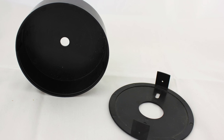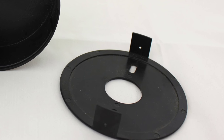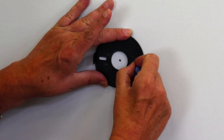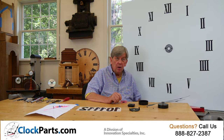The wall mounting bracket is attached directly to your wall using the larger coarse screws through the two oblong screw slots. Drywall anchors are included for modern drywall or sheetrock walls. Align properly and pre-drill a slightly smaller hole in the drywall, then gently tap the plastic anchor into your wall.